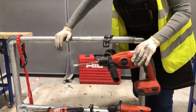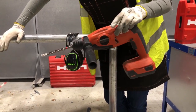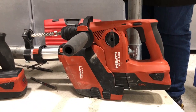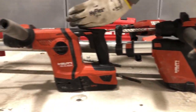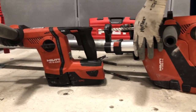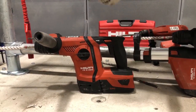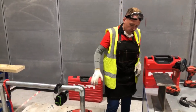In summary on the rotary hammers: TE2 — nice and light, compact, 6-8mm holes, drilling plugs, a remarkably good and powerful tool for the price and weight. TE4 — your workhorse, it'll do a bit of everything, covering 8, 10, 12, 14mm holes no problem, with an optional dust removal system. And then the TE6 — the most powerful, the most bang for your buck. The TE6 also has a dust removal system, so consider it for anchor setting and serial applications drilling 10mm up to 18mm holes.